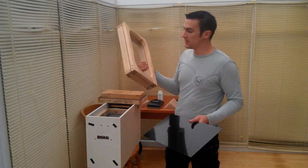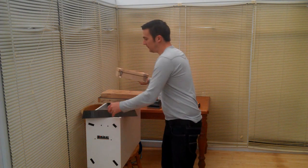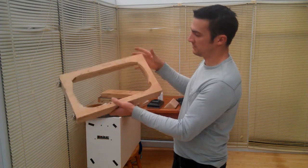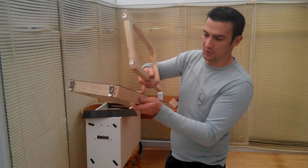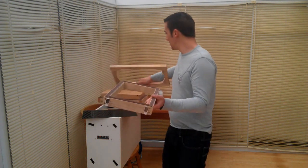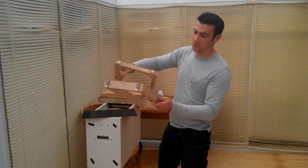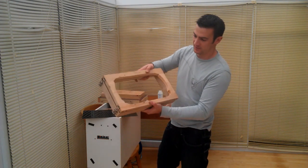My vacuum former uses what I'll call a sheet frame. I've used clasps from carry cases to clamp the two halves of the frame together, and rubber foam door seal from B&Q. I've also marked it up so I know which sides go with which, because when you make frames, making things truly square just doesn't work — if you spin it round it doesn't quite fit the same. So I keep it oriented the same way. I did end up with a bit of an interesting shape in the corners, and I regret making the frame as wide as I did.